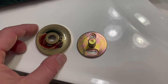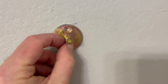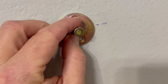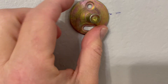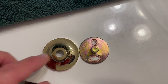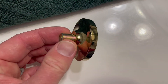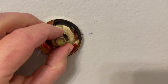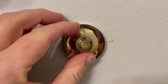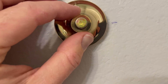Here's the bracket system that this specific Kohler came with. Basically this goes up onto the wall, so we're going to be drilling right around here since that's going to be the edge, and then we can anchor directly into the stud with both the top and the bottom on this side. This is the brass ring that goes over this little hanger, and that allows it to look really nice once it's on the wall. As you can see, there's just a little bit of space between those two, so that's the room I'm going to leave on the edge as we put this up.